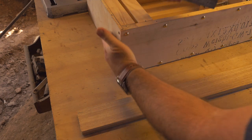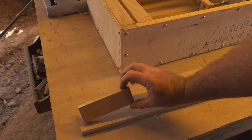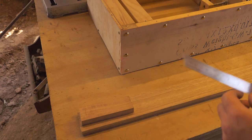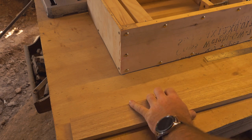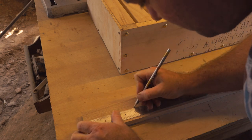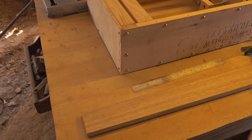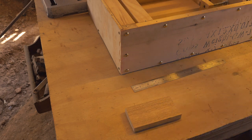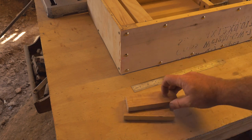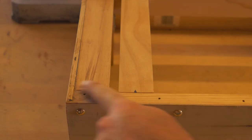The next part we're going to move back to our thick leftover wood. We're going to measure the depth of our box from the corner — mine is sitting at 5 inches deep. We're going to cut a small piece from our thin scrap timber for the narrow neck, and also make one that is 5 inches on the thick piece of timber to support our wider guitar neck. I'm going to mark that up with the square and then cut that piece of timber. Now I've got one thick piece at 5 inches and one thin piece at 5 inches — these are the parts that will go up against the side of our Apprehension Engine to help support our guitar necks.